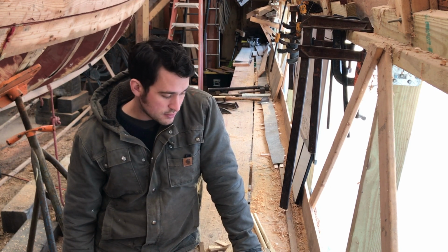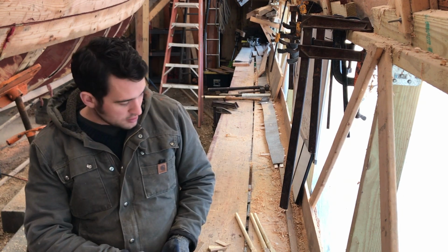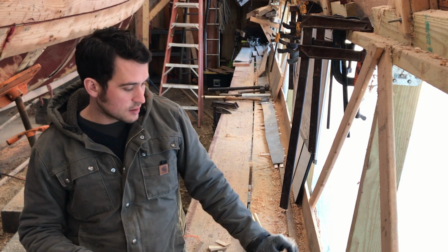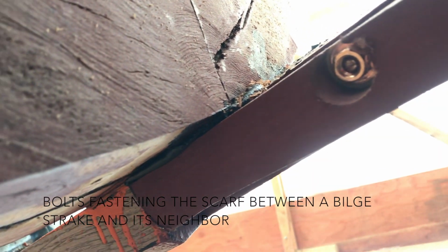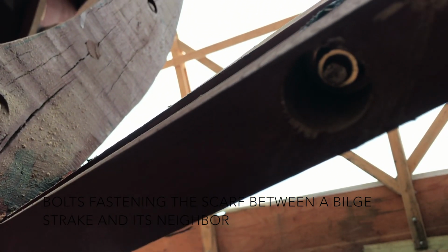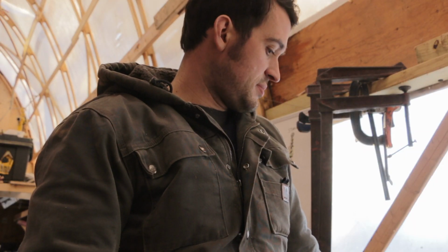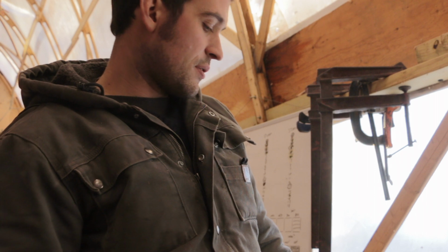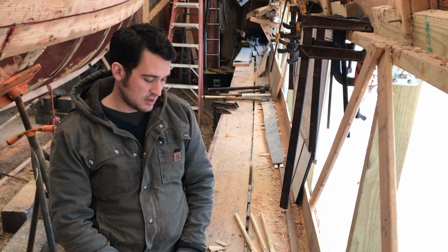They're the strongest way of fastening anything, with mechanical fasteners that I know of, anyway. But they do have some downsides as well. They tend to be a big chunk of metal, which is more expensive, heavier. You have to go all the way through a thing in order to fasten. A nut and a washer and a threaded part of a bolt is a fairly thick assembly. So if you're putting something together where this needs to be hidden, your counterbore is going to be pretty substantial, and sometimes that's not okay. You can't remove that much material always.